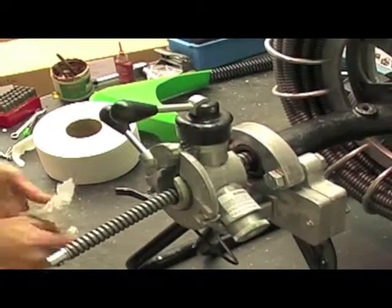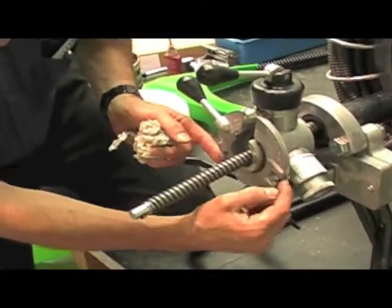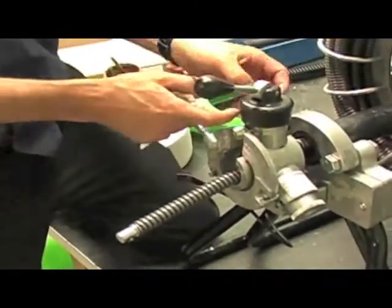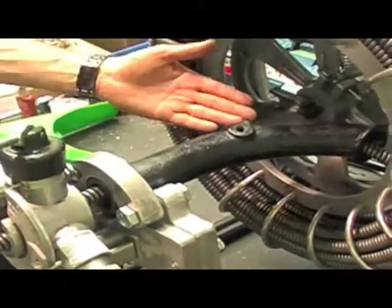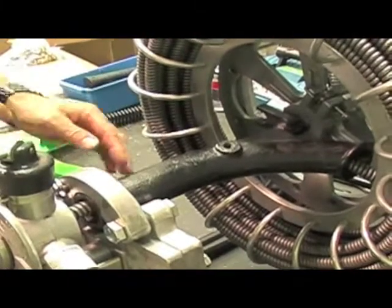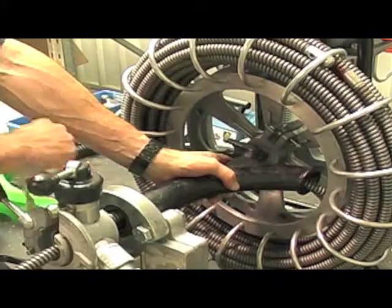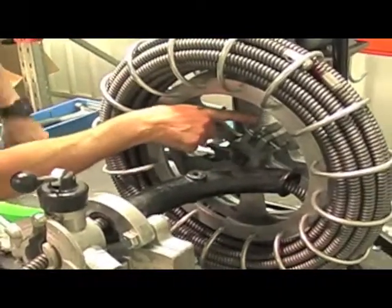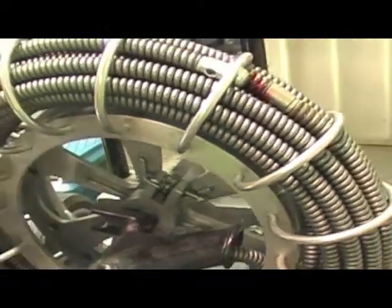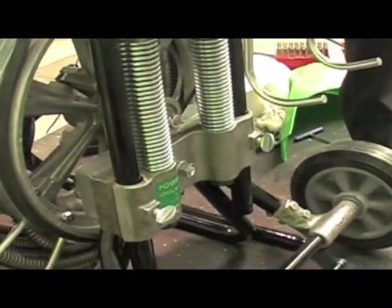Going back to an overview: the main thing is the correct adjustment — don't screw them in too far. Just flush with there, or just clearing the little U-shape. Have that grease around the top thread because you're always adjusting that. Don't run it dry. Your bronze torque tube bearing is going to always have a little bit of movement. If it's got excess movement, you know that bronze bearing's worn or there are worn parts in it. This is like your driveline of the whole machine — pretend it's a car, it's your driveline. So if this has got lots of movement, it's going to be wobbly and noisy. If you eliminate it, just get three to four millimetres max. Always make sure that locking pin is always locked towards the motor — it's going to stop the drum coming forward. The wing nuts in the back holding the loading bar — make sure they're locked in before you use it, in case the handle moves around and knocks on your switch.